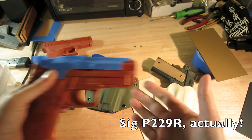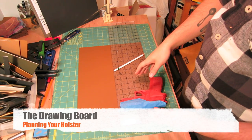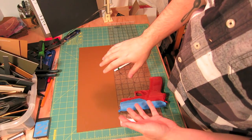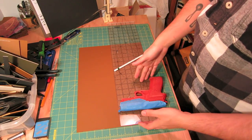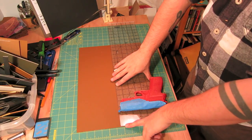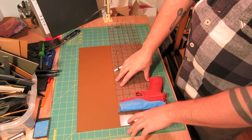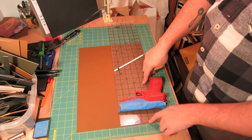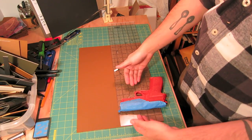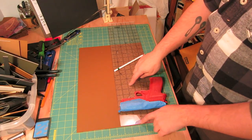Today, we are going to be making a holster out of the .060 thickness Coyote Tan for this Sig P226. When we get back, we're going to get started on that. So this is what you could call the drawing board — this is where you start to implement your idea of how you want your holster to look, and you cut your Kydex based on your overall plan. I know that all I need is a 6.5-inch wide piece to start with, because that accommodates any curving or small warping that could occur during the pressing process and gives me enough room for a sufficiently wide holster.